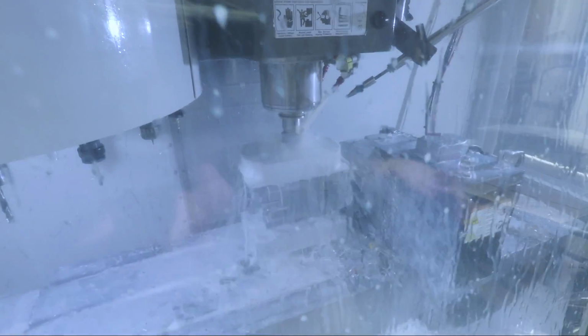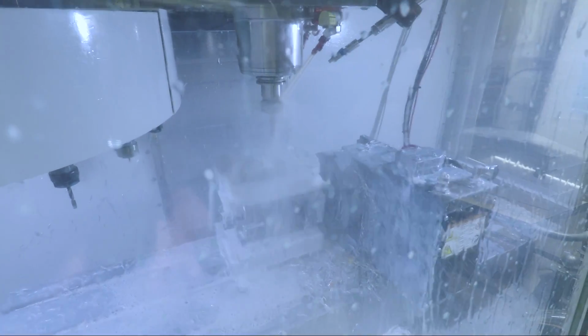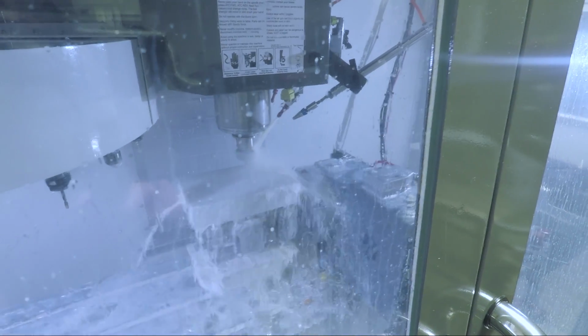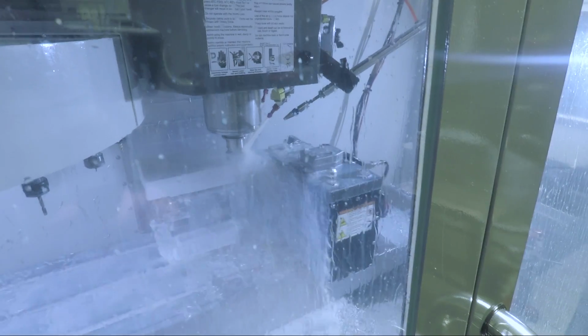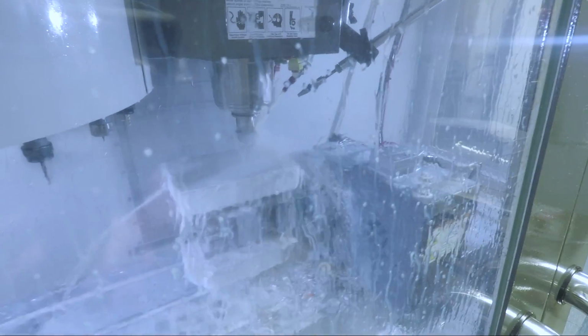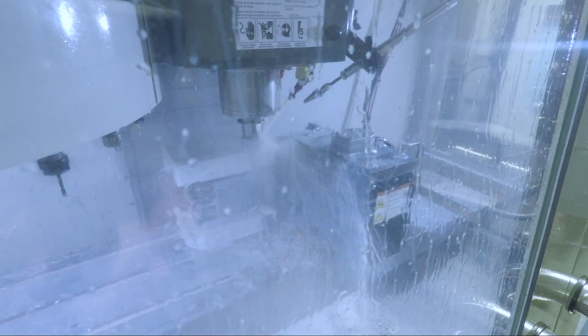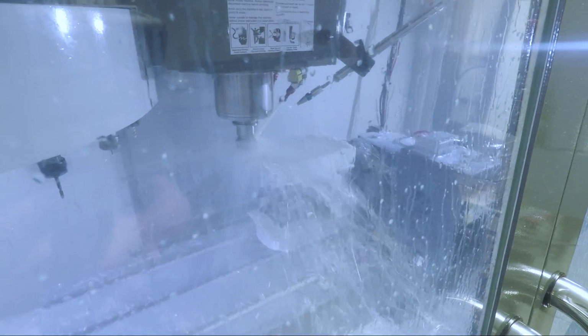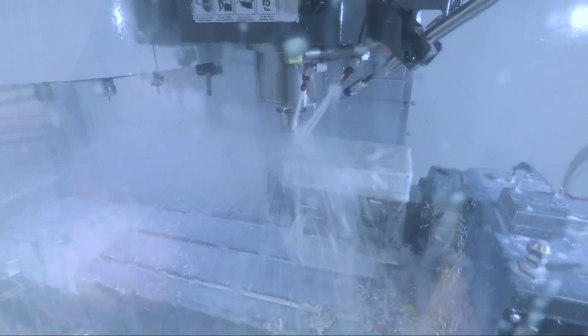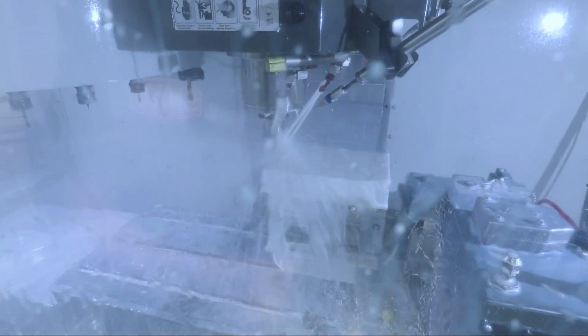So it sounds like a really good cut at 500 inches a minute. That sounds great. Yeah. It's just so counter. Oh, as you're roughing that or ramping that tool out, you're using a tool that's 4 times longer than you need to, but saves you a tool change, saves you a tool holder. Yeah. When I programmed it, I expected a little bit more chatter. Yeah. And so I went light on the feeds and speeds, 350. I usually would have done like 400, no problem. But just that long of a tool, that long of a cut.